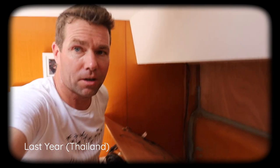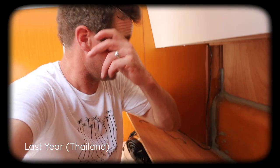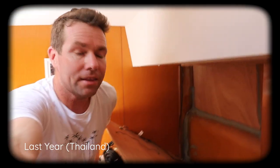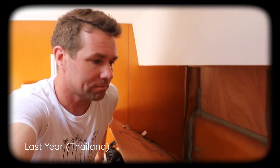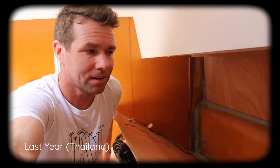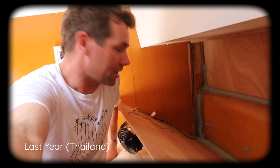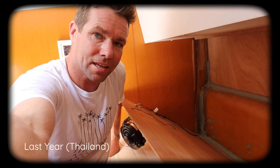What I've done in a lot of parts of the boat is dig the gray putty out and replace it with actual fiberglass tape and resin. In the end, our boat's going to be maybe 10 or 20 pounds heavier, but it's going to be a lot more solid. I'm feeling pretty good about Nahoa these days — I think she's going to be a rock-solid boat going forward.